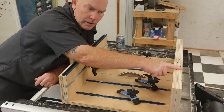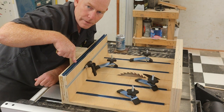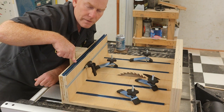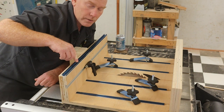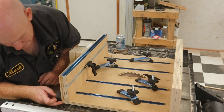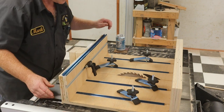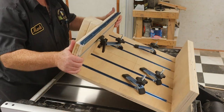I used what I think was maple plywood — it's a 10-layer plywood, really nice, and it was only 65 bucks. It lays down flat. I glued together two sheets for the front fence. I was going to do a single piece for the back fence, but it had a bit of a bow to it, so I cut another piece and doubled it up and glued it. I did split the edge right here though, so I've got to squirt some glue in and clamp it.